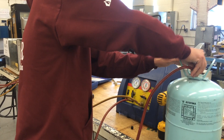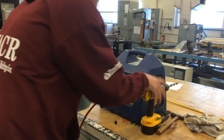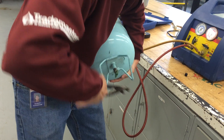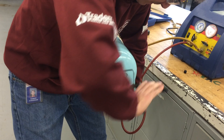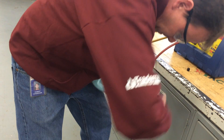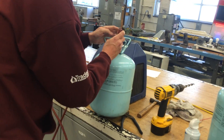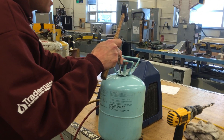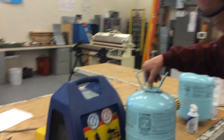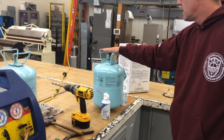We can go ahead — when I take this off, we shouldn't hear any refrigerant leak out, and we're good. Now I can go ahead and snap the valve off just by using a pair of channel locks. You snap the valve off at the handle by twisting it open and keep twisting it until the valve eventually cracks off — sometimes you can bend it and it'll snap itself. Then I'm going to try to pop the plug, but the plug is designed to blow out, not in. She's still having a little bit of refrigerant left even though we've opened up the valve all the way, so this valve must have gone bad at some point and it's been sitting around too long.